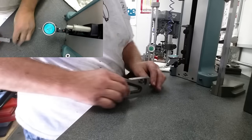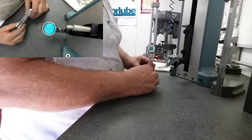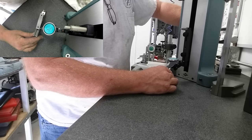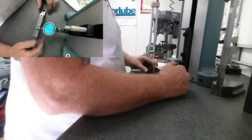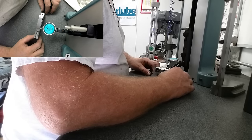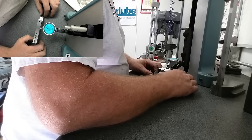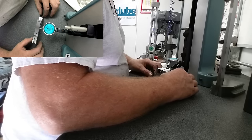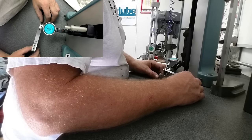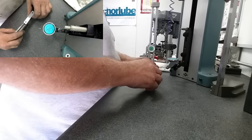We're going to put it down here in the middle. Let's get down here in the middle, tighten our thumb screw, and see how we do. Side to side — zero, zero. Go here in the middle — zero, zero. Pretty good. Out here on the end — about a tenth high. No big deal. Let's take it all the way down to the bottom and show that to the camera.